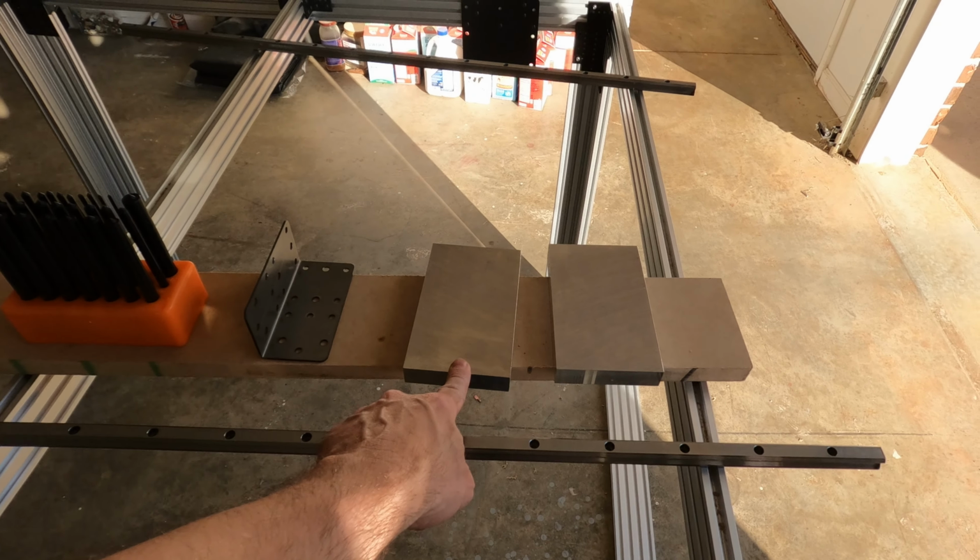And I wanted to show you these brackets. I have all of these corner brackets installed. You can see all the small fasteners that lock it into the extrusions, and then the quarter inch holes that are left where I will drill holes and put the fasteners all the way through. And I actually started doing that this morning while I was waiting on the guy to show up to buy the CNC machine. You can see here I have drilled through. There's extra holes, so I'm utilizing different holes for different positions, but I have a hole drilled through both legs and both of these extrusions on the X and Y axis all the way through. So those are sandwiched together and bolted up snug, and that makes a very solid joint in the corners.